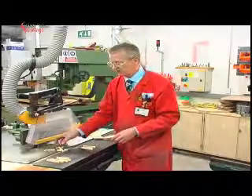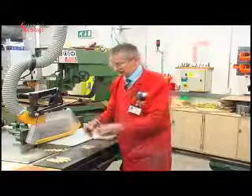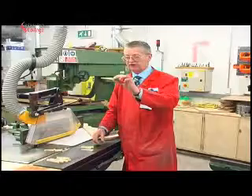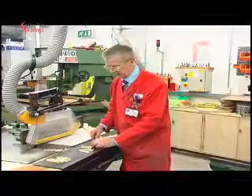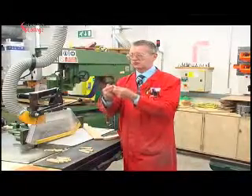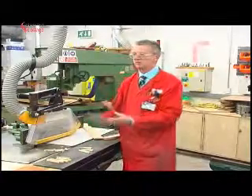So if you were to cut those in a bit of a rush and use them, whatever you're making is no good. If you have a look at wedges number three — well, they kind of started off okay. But the more we did, we went from the grain running along the length of the grain, to the grain running across the grain again. So they started off okay, but then they failed.